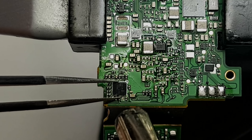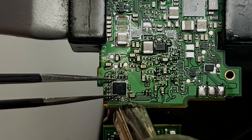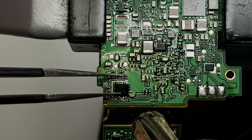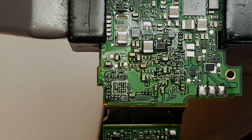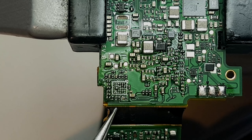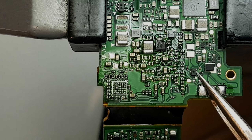We took it out. I also messed up some parts here, but it's not relevant because this motherboard is dead, so I will not stress about it. This is the part. I will start my soldering iron right now, but I will not take it up in heat just because the part is so small — I don't need so much heat to hit it. I will hold the part with my tweezers.